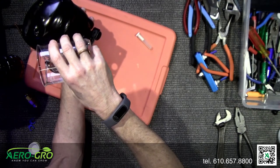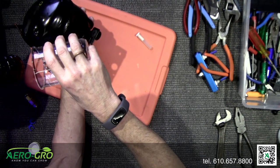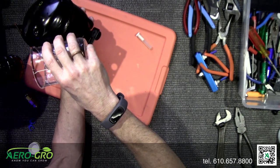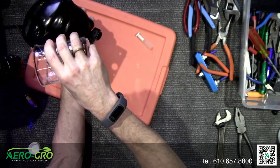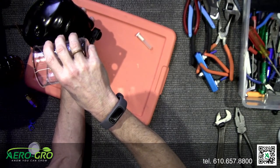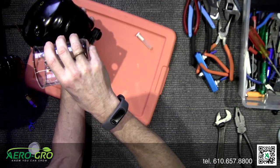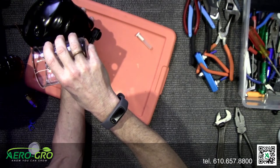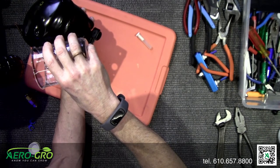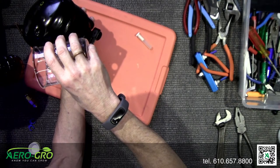Also, here's another thing to keep in mind. Not all retailers of tubing are very good at listing those measurements. So sometimes it gets a bit confusing. Which one's the outer diameter? Which one's the inner diameter? Did they mention it? Did they list it correctly? So just keep an eye out. Just be careful that you're looking, in fact, at inside diameter or outside diameter specifically and not mixing them up like some of the manufacturers do. I have run into that.